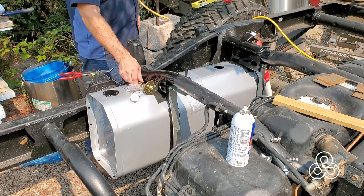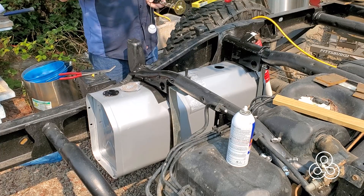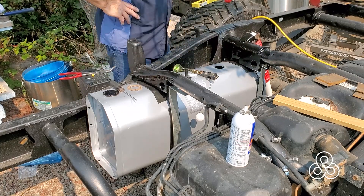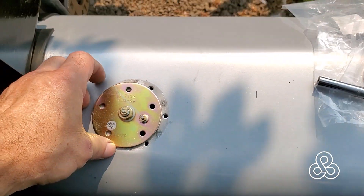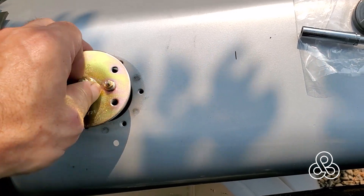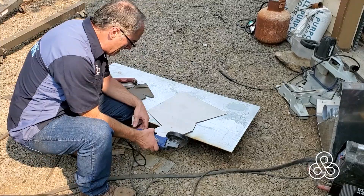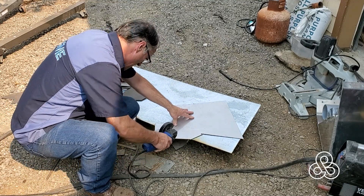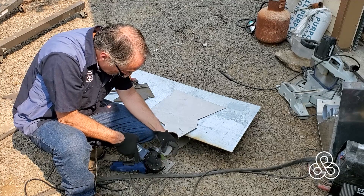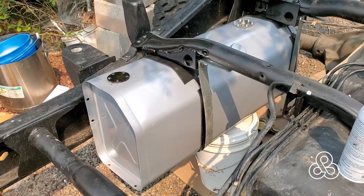If there's not one problem, there's always two. I have this fuel sender that I bought that was supposed to go with this tank — I assumed it would since it was advertised next to it on the website. But you're about to see that's not always true — it's not quite the same, is it? Luckily, this fuel sender is super simple: just two leads, a ground and a positive lead, and that positive lead just feeds to a single hole in a little disc. So I'm going to take this off, drill one hole and then the five bolt holes to match the pattern. I had a sheet of stainless steel around, took my cutter, roughed out a disc to replace the original, ground it smooth, drilled a single hole in the middle and then the five holes around the outside edge to match the tank. And there it is — there's always a problem, but always a fix.